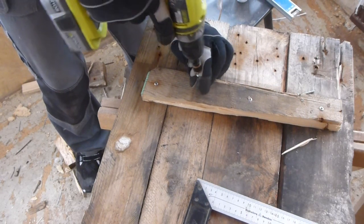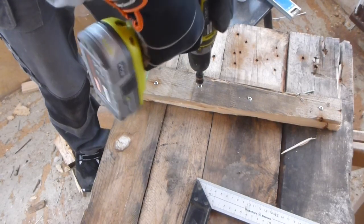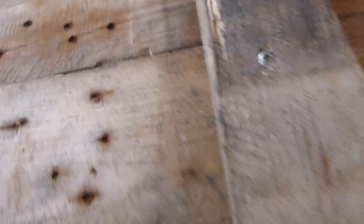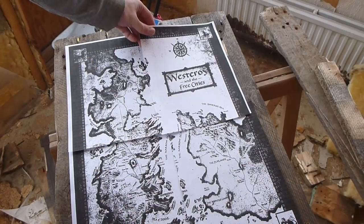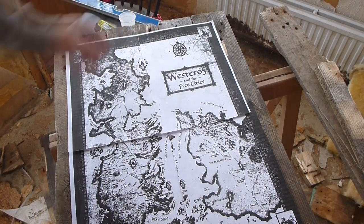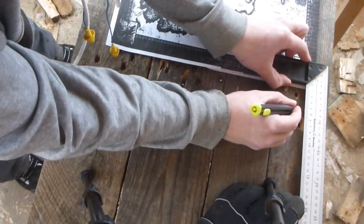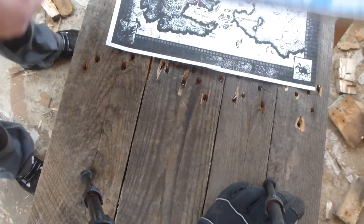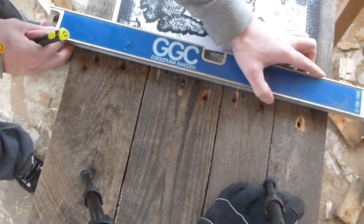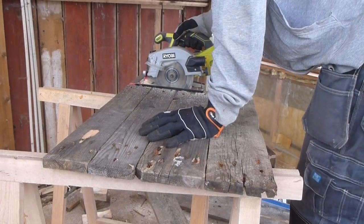When that's done I simply place a screw through the scrap pieces and into each of the tabletop planks. It's once more time to place your tracing picture on the tabletop. This time you need to center the picture in height and width, so you can then cut the 4 planks in length. This will leave you with a complete tabletop.